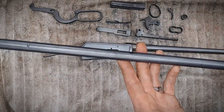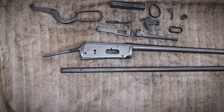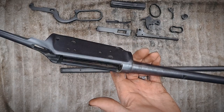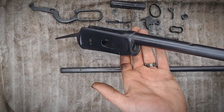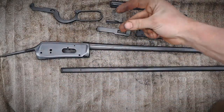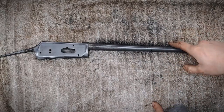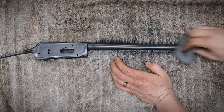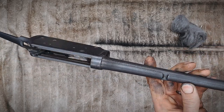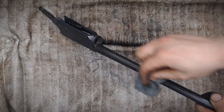This is a major win. I am completely satisfied with how these turned out. We have to do the final carding next, and then I'll get you some video after they've been coated in oil, because this is not the final finish. When you get oil on this it's going to turn about four shades darker than it currently is. You can already tell — it is not bare steel, this is completely blued and it looks incredible. For carding, use four-aught steel wool — do not do this on your wife's carpet or kitchen table. Be really careful of sharp edges, as you could wipe away the bluing there by focusing all the friction on one area. Whether you use steel wool or denim, it'll obliterate the finish, so just be careful.